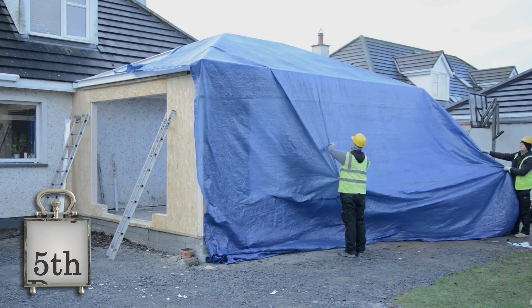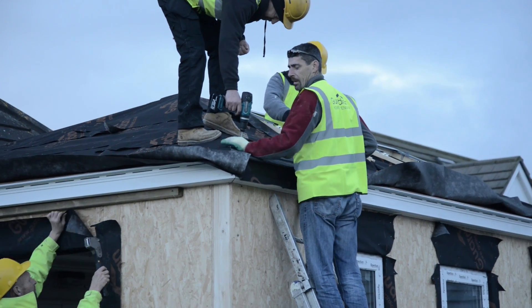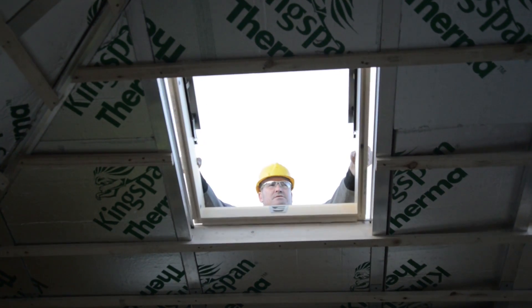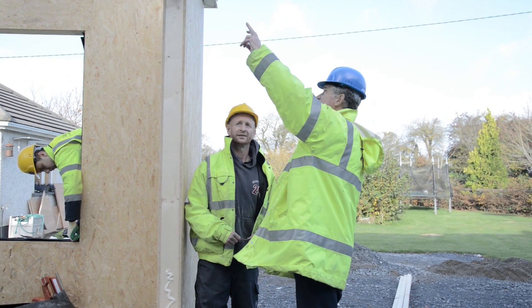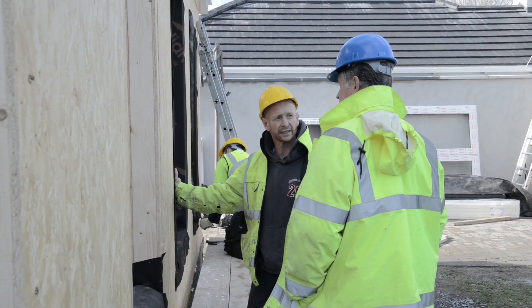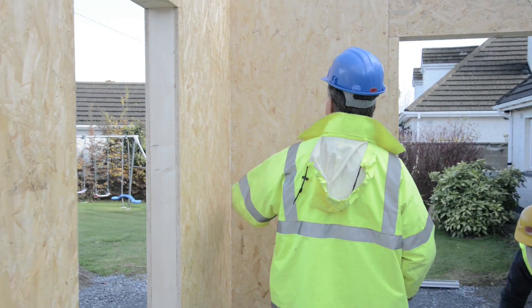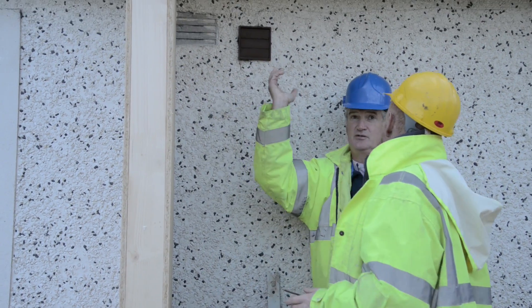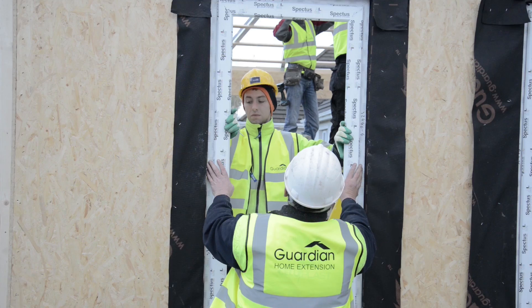First thing next morning, the team gets straight back to work, with the aim of having a fully sealed, enclosed room by the end of the day. Brian, the project's engineer, drops by to inspect the progress. Essentially, in any project, the first thing you do is look at the foundation. You would normally check at ground floor slab level, then definitely at roof level, to make sure everything is tied up and stable before you start putting the roof on. You also want to look at the interaction of the extension with the existing structure, how the original building is being affected, how load transfer is taken care of, and do a stability check to make sure the new structure is adequately restrained and tied. Once the engineer signs off, the team are able to carry on.